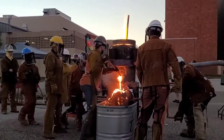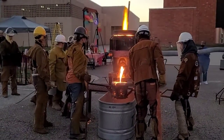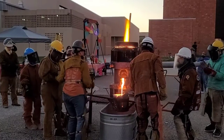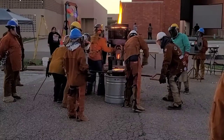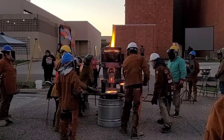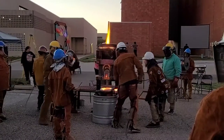Right now they're removing that pot. There they go — they catch the iron in the ladle. That iron is between 22 and 25-ish hundred degrees. Using a skimmer to get all the dross off the top of the ladle. Once they collect that metal, it's pure metal, and all the impurities rise to the top so they can just skim them right off. That's what he's doing now.